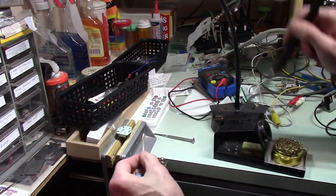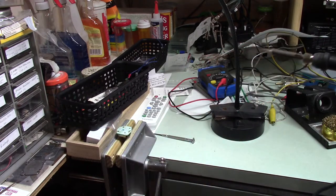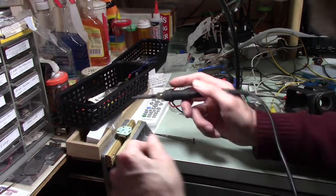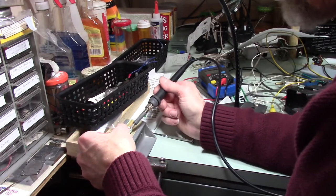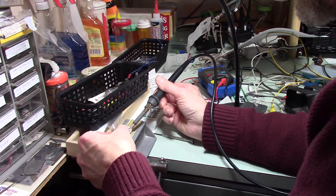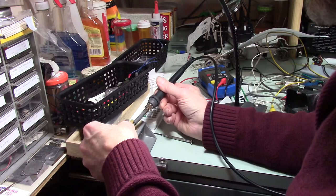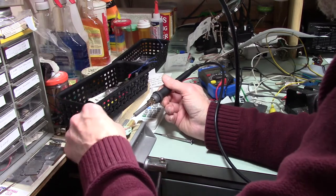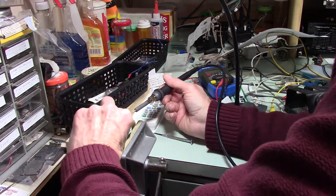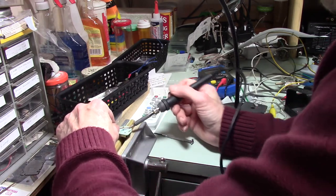I'm probably pushing my luck, but right now this switch does not work. And the thing that leads me to believe that this is my problem child is that if I look at that, sucking all that in. If I play around with this switch, I can get the relay for the rear position to function. And sometimes, occasionally, low speed will turn on.